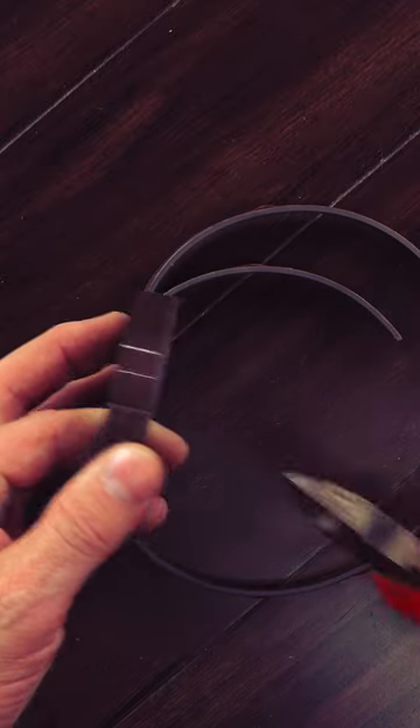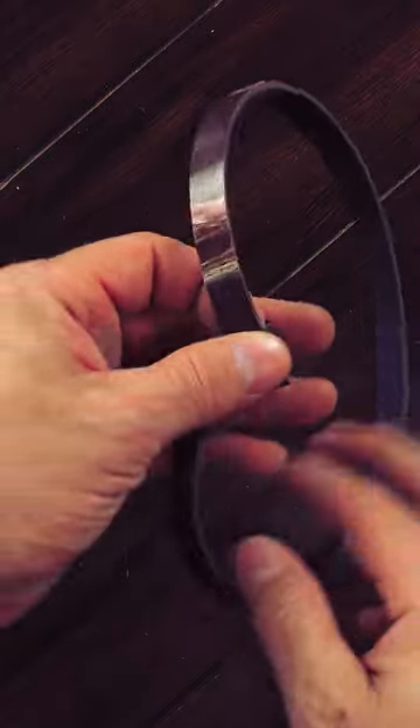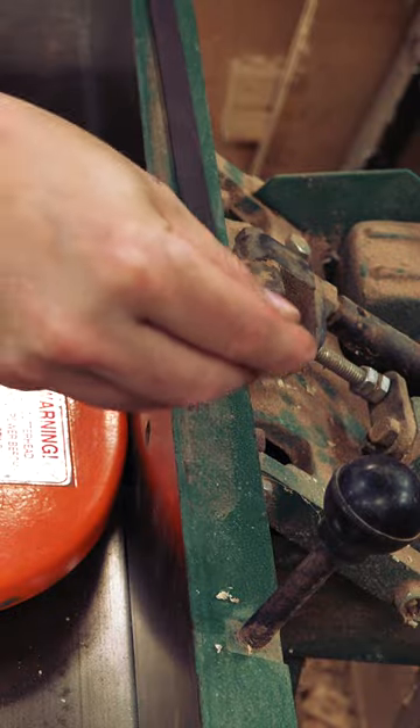They make magnetic strips that you can buy in a roll. I'll cut a piece the length of my infeed table and add a small piece of double-sided tape on the end. After flipping the board over so that the ridge is against the fence, I'll run it through again. As you can see, I've jointed a board that is wider than my table width, and it only took a long refrigerator magnet to act as a surface spacer to do it, which I store on the fence so I don't lose it.